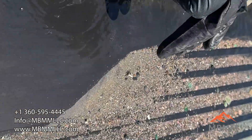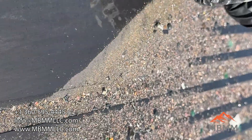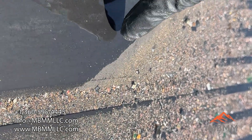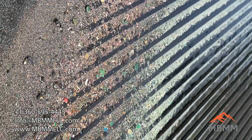Typically what we see with PCBs is a copper line. There's actually a lot of gray material in here, which might be a lot of solder. And then right at the leading edge there are little yellow flecks — that's the gold, which is more dense than the tin solder, bouncing its way right to the head of the little sandbar we're making with our metals. The gold is right out in front, the tin solder line right behind it, and then the other base metals clinging into the number one. It's working really, really well.